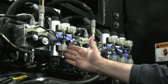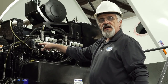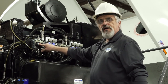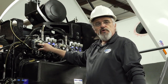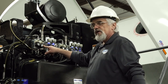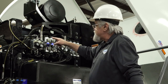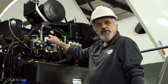On the front of the front manifold, what we have is a two-way valve, which is actually a lock valve, the three-way valve, and then the directional valve. The lock valve locks the broom when it's in the up position and will not allow it to drop or drift. The second one, the three-way valve, allows the broom to lift and spin. And then the directional valve lifts and lowers the broom.